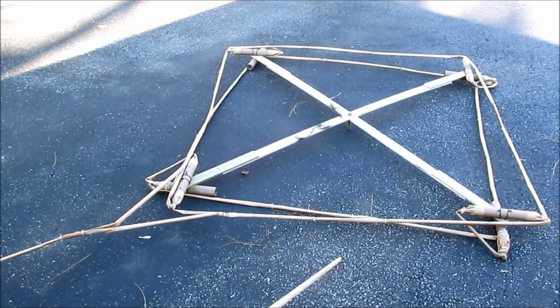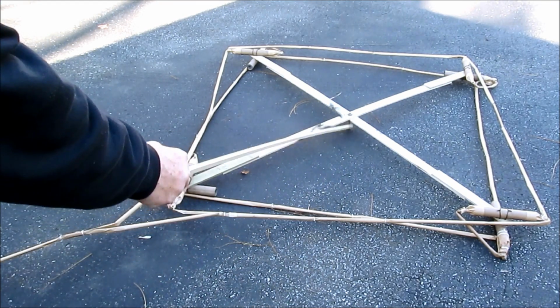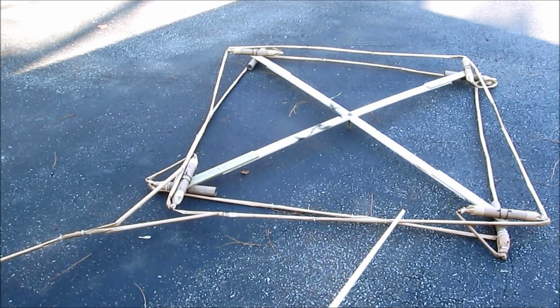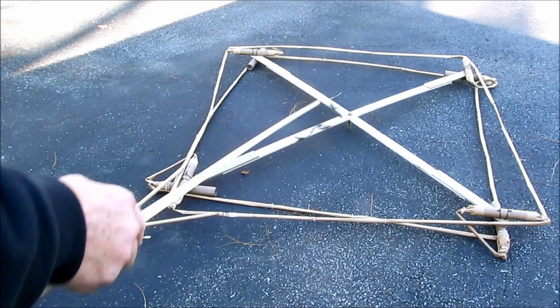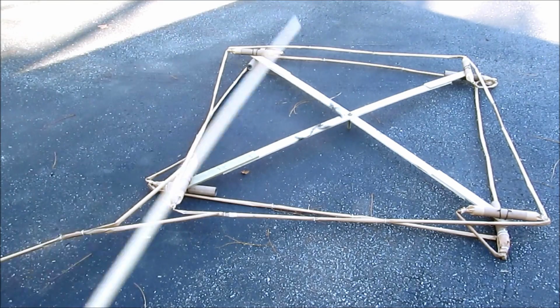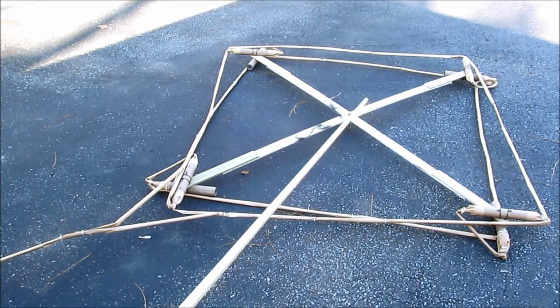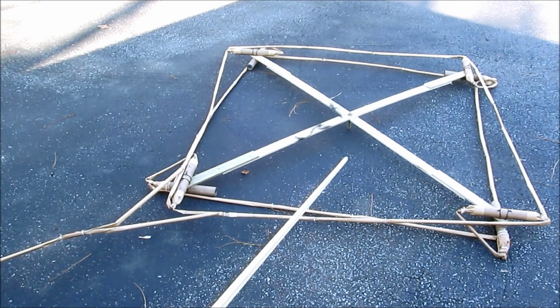Here then is one of the fully assembled and fused wheels. As I said, looked at from the front with the spindle hub, the threaded nipple hub going to the back, to the rear as a standoff. Both of the wheels turn clockwise at first and then reverse counterclockwise. But one will be mounted to the front of the support, and one will be flipped around and mounted to the back of the support. So they will counter-rotate when viewed from one side where the audience will be. And then they'll reverse and slow down and then begin counter-rotating in the other direction.